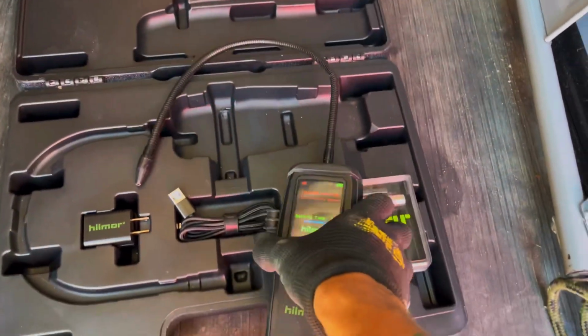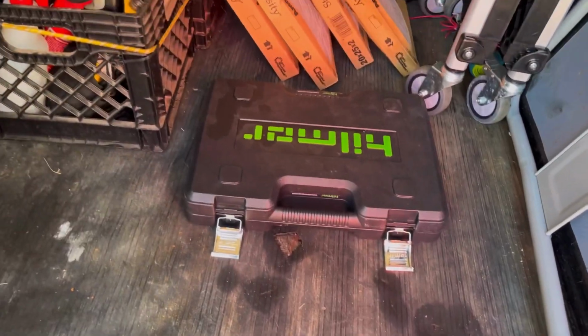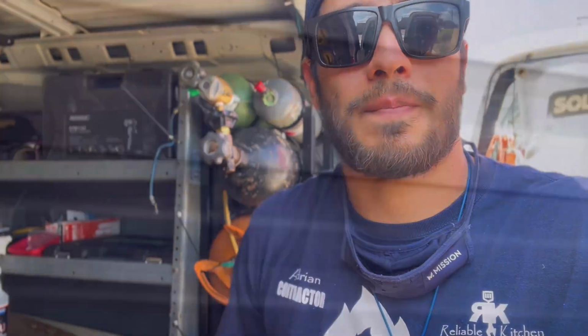And I basically just told them we can charge it up, since their main concern was that somebody else had told them they had a bad compressor. So I got to verify that the compressor's good and all that, and do a leak test. The easiest thing was to add refrigerant, and I told them we couldn't recover, and we'll charge them for all that.